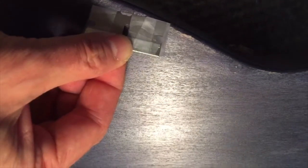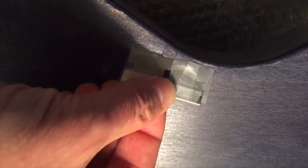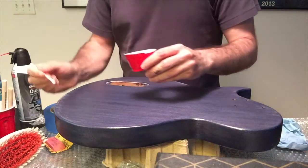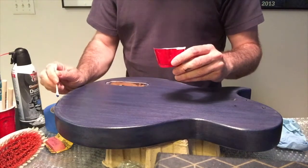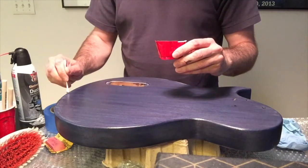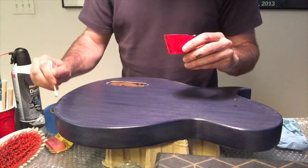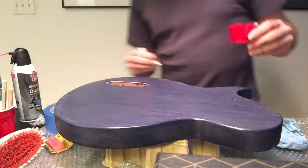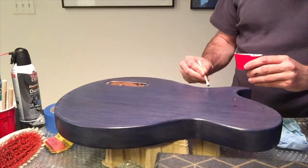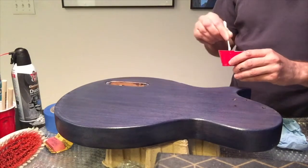You can see it just peel up that little layer — that'll work pretty good. Hopefully after more clear coat the remaining spots will be less obvious. To fix the parts I sanded through along the edge where wood now shows, I applied some new stain with a Q-tip. Of course I'd thrown away all the original color, so I eyeballed a new one. It came out much bluer, but it's a tiny amount and not really noticeable. Pro tip: hold on to any remaining stain until you are completely done with the guitar — you might need it for touch-ups.